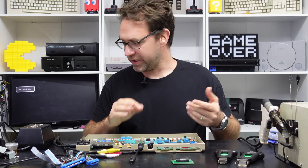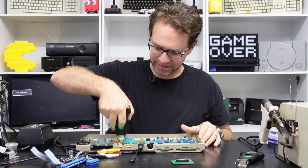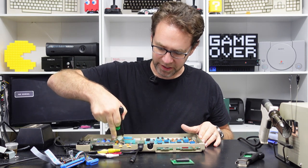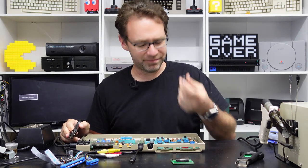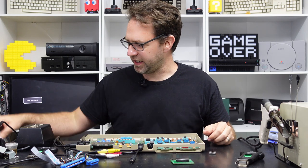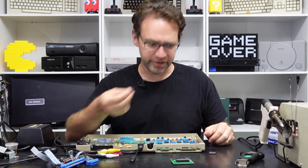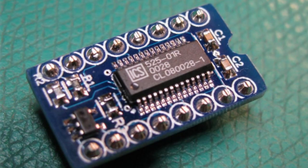It's got an internal short somewhere and that's got to come out. This board was working just fine previously, but another dead MOS chip isn't a surprise. So I borrowed another 8701 which I'll stick in here for now, but I have ordered some modern replacements from Jeff Burt, whose channel you can check out.